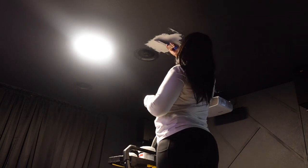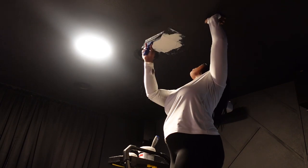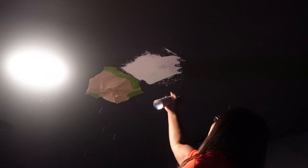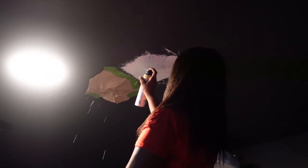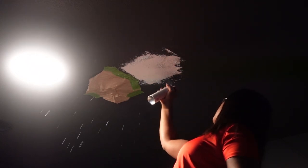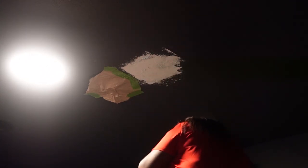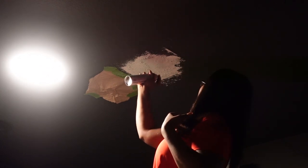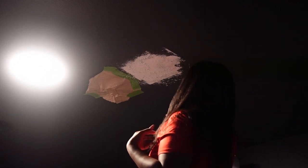Then I came back and I am going to apply some textured spray since I have textured ceilings and walls. This is the can of texture spray that I used. There probably is a better method for adding texture to the ceiling, but I'm using a leftover spray that I had when I repaired the patch from the stairs. Really good tip — make sure everything is covered because the overspray is crazy. I made sure that all of the carpet and the chairs were covered before I sprayed.